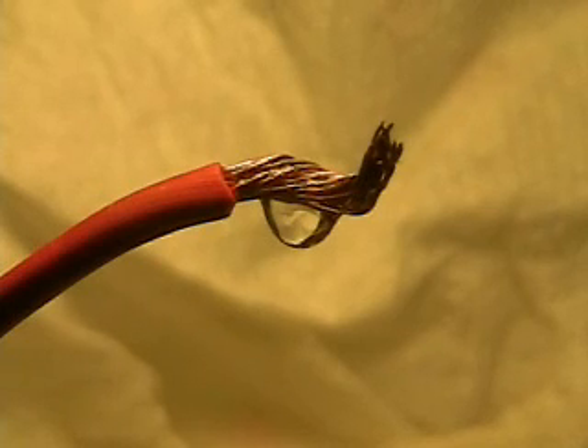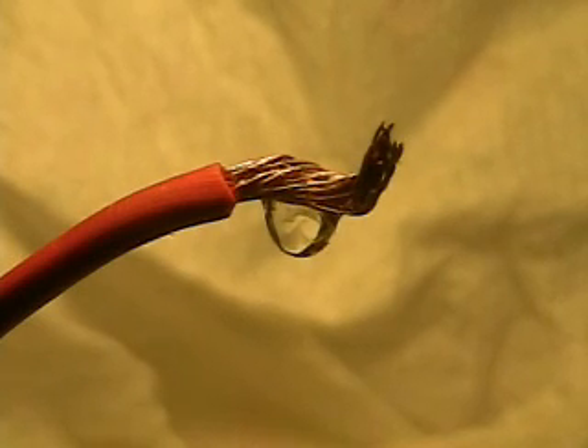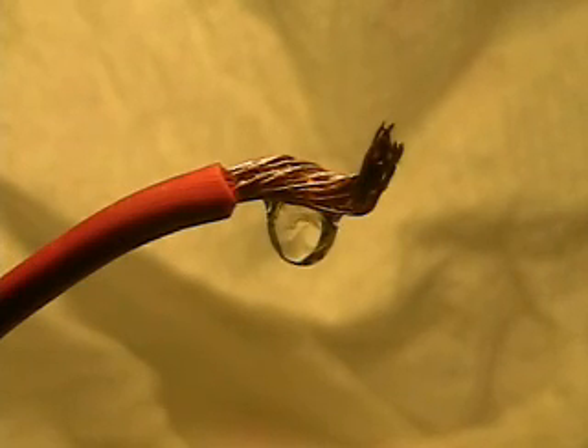After all the work trying to find all the hydrogen leaks, suddenly we come up with one last leak. The only way I can see to solve this problem would be to put a clamp on the ends of the wire, to clamp the insulation tight against the wire enough so that the strands in the wire won't allow water to come through it.